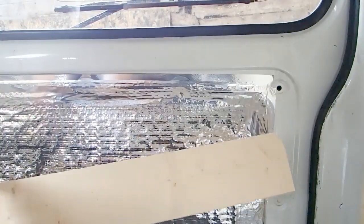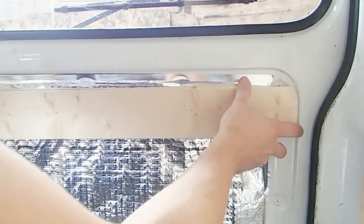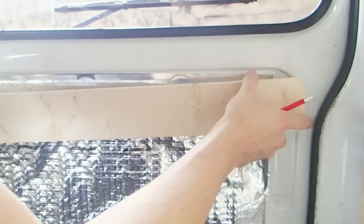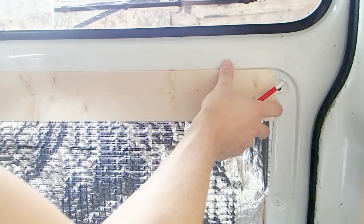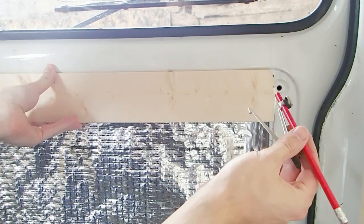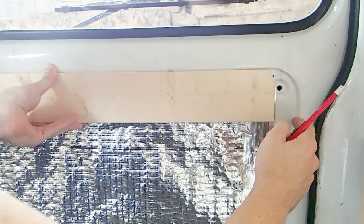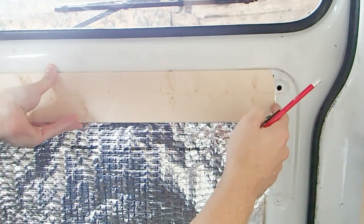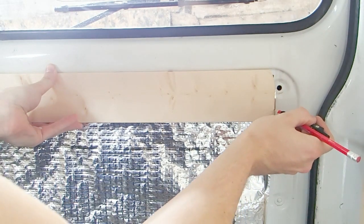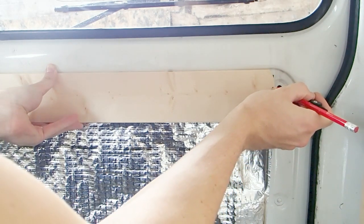So after we've cut this out with the chop saw, we want to check that it fits within your template. Okay, and we're going to take a pencil and a compass. We're going to take our workpiece and push it a little further along from the curve, making sure that it's still nice and straight with the rest of the template. Okay, and we're going to stretch it out until it reaches this side of the template where the curve is, but also reaches the straight part of the wood here. Okay, mine's about there. And then we're just going to follow it round, pushing the compass up, and that's going to give us our outline.